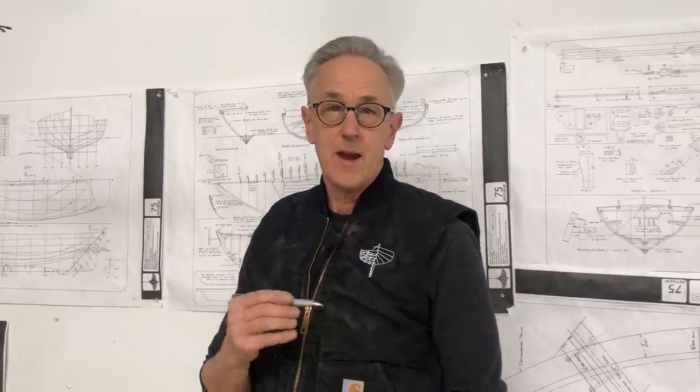And I'm assuming that back in 1985, it was a little easier to source 3/8 mahogany plywood. Not so much today. So I'm going to use 3/8 marine plywood, especially since it's going to be canvas covered anyway, and I'm assuming that the mahogany part was because mahogany is a rot-resistant wood.